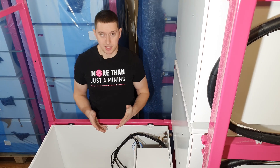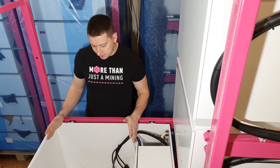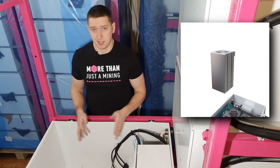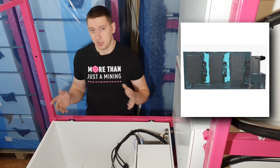For those who are not familiar with immersion cooling, I will briefly explain how it works. Here in the large section, miners are being completely immersed in a dielectric liquid. It could be ASICs or video cards that heat up during operation and transfer heat to the liquid.